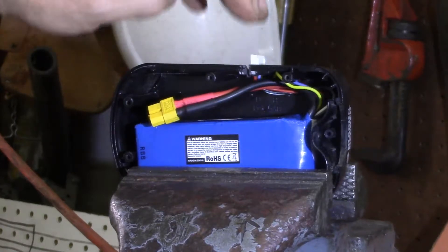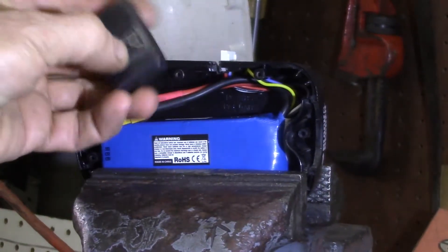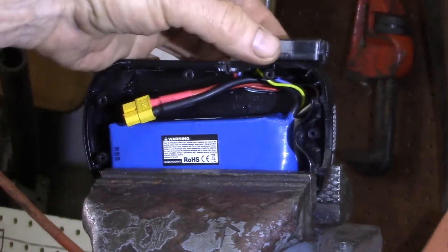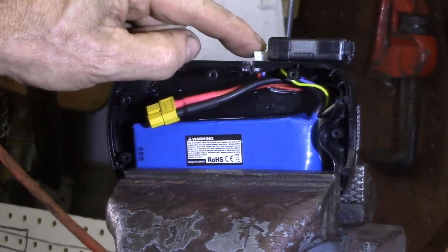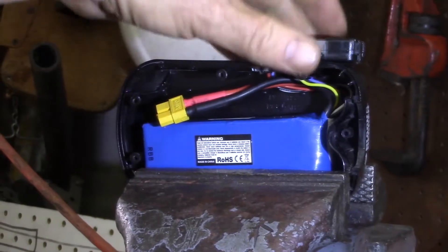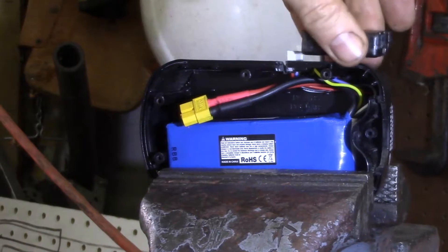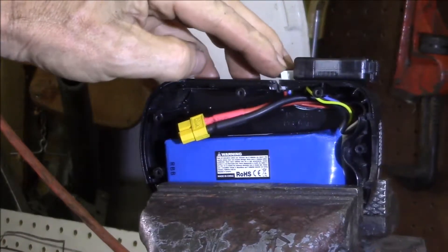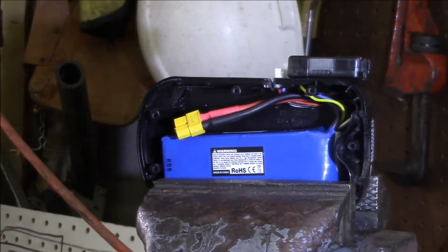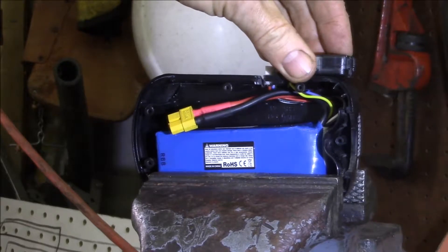For the battery low voltage monitor, I'll show you what I plan to do. That's the low voltage battery monitor, and I plan to put that out here on the outside. What I'm going to do is get a female balance plug connector to go on to the end of the male connector, and then I'll get a male plug and basically make a little right angle adapter. I couldn't find one pre-made, and then that way I can plug the little right angle adapter in here. I can put a little bit of velcro tape there, and that way I can just plug the monitor onto that battery pack, and when it goes flat, take it off.